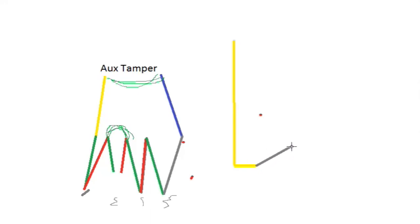But again, we'll use a door as an example, and I'll show you the different types of contacts you get for a door, because you get flush contacts, and you also get surface contacts. The ones with silver screws and the other one's going to be like a bronze colour. Obviously, it does depend on the different types of contacts that you use. And then here we go. So from here, we're going to have a 4K7 resistor going around this reed switch.